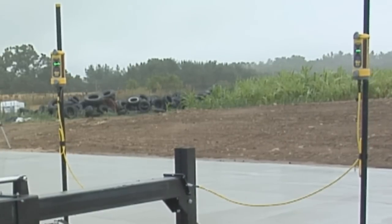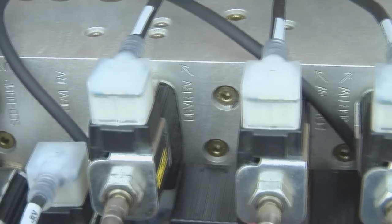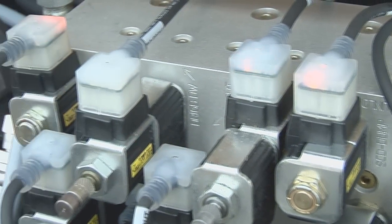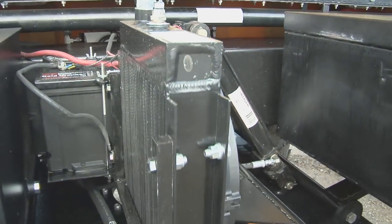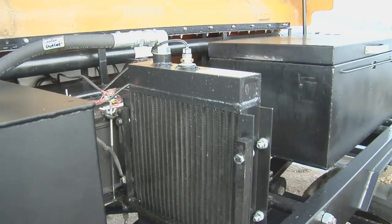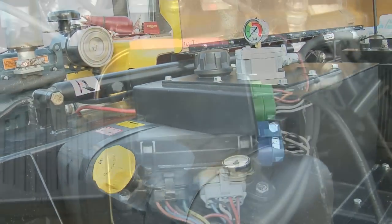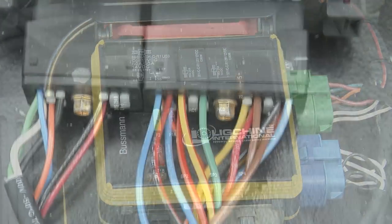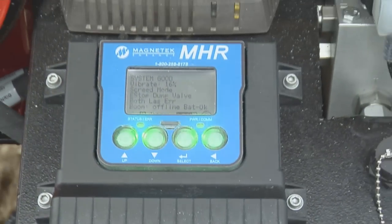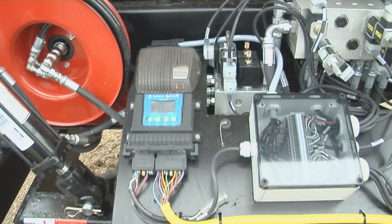Every Screed Saver ships with two Trimble LR-30 laser receivers with built-in 360-degree range of sight. We incorporate a state-of-the-art hydraulic distribution manifold with every machine function controlled by Parker proportional valves that light up when activated. Reliable operation is ensured by a fan-cooled hydraulic fluid system with multiple filters and an array of pressure and temperature gauges verifying fluid integrity at all times. All electronic functions are protected by a readily accessible Cooper-Bussmann fuse and relay box.